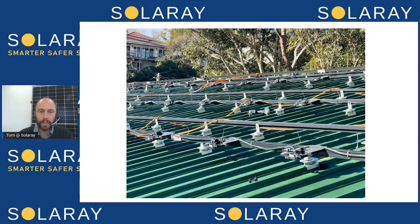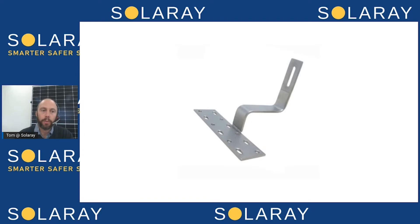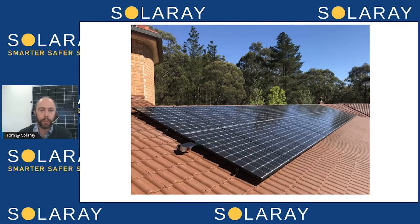In this photo you can also see the rails — that's what the solar panels are mounted onto. And underneath the rails, in this case, we've got clamps because the roof is clip-lock. The other common roof types are tile or a standard metal roof such as colour bond. Here is a clamp used on a tile roof, mounted onto the roof itself, designed to slip between two rows of tiles, so we don't need to remove or break any tiles. After it's all installed, it looks something like this.